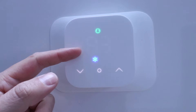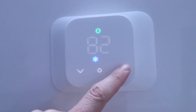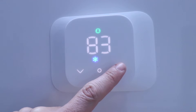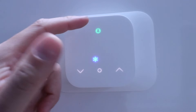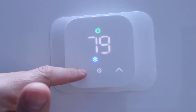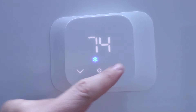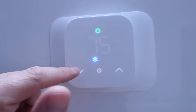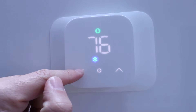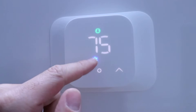Clicking again we're at cooling mode. At 83 degrees our cooling will turn on and we would have air conditioning. That little snowflake means you're in cooling mode, and up here the little tree symbol indicates you're at an energy set point that helps you save money. Around 75 degrees that eco symbol disappears, so if you want to save energy set it over 75 degrees.